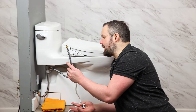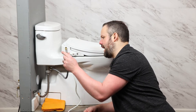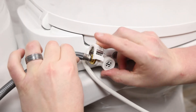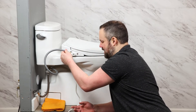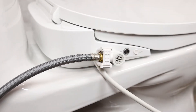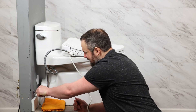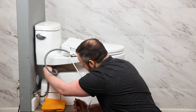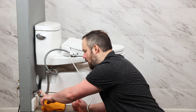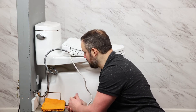The EcoNova is one of the only bidet seats on ManyBidets.com that has a quick disconnect for the water supply — very easy to do. Simply slide it in and use the supplied clip to clip it into place. Then use the other part of the clip and snap the two together. Now let's make sure there are no leaks — we have our rag ready. We turn the water supply on. The connections might feel cold because cold water is going through them, but they are dry. If you have any leaking, turn the water supply off instantly, re-tighten everything, and check for washers.